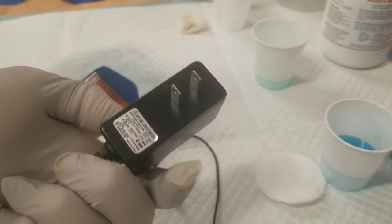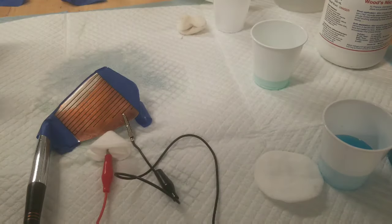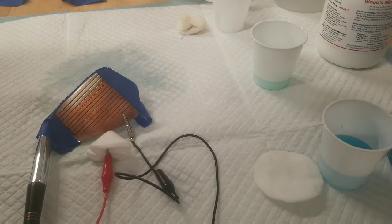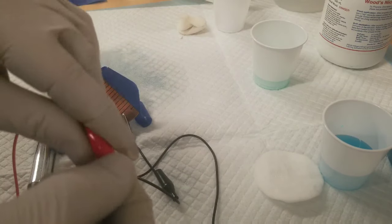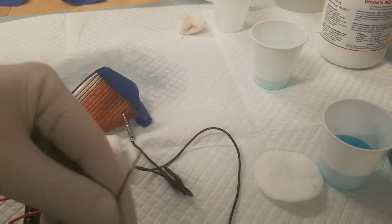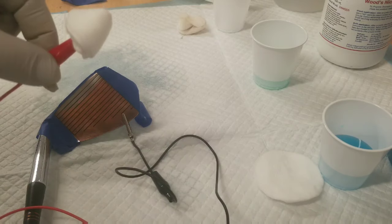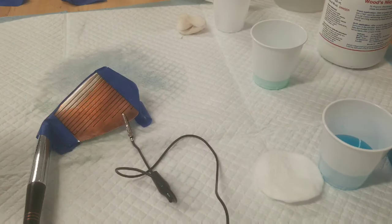Okay, so I have my 5-volt charger. I don't remember what this was for, probably an old phone charger or something. And again, there's going to be a link in the description on how to make your own. Same steps here. I'm going to connect the leads. The red goes to the red, which is my positive. Black goes to the negative. The negative is connected to my club. The positive is connected to this little pad that I just did. So plug that one in.